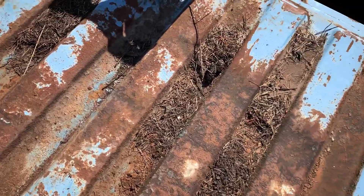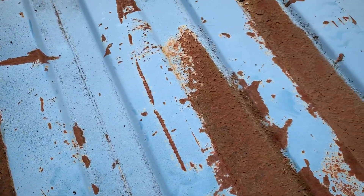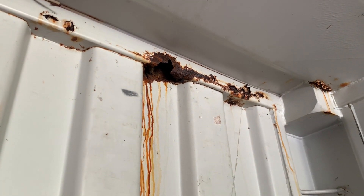On a gorgeous day like today it can be pretty hard to remember that we're in one of the wettest parts of the country out here in western Oregon. We get about 170 days of rain each year. While shipping containers are designed with thick zinc-rich epoxy paints to be pretty durable in wet conditions, the container from the last video had been sitting on the same site for about a decade. Pine needles built up on them, acting like mulch, causing water to pool and stagnate. Any micro fracture in the epoxy lets water through to the metal — metal swells when it rusts, creates more cracks, and you get a cascading effect. In some parts the container was rusted pretty much all the way through.